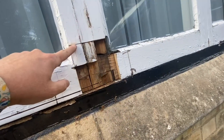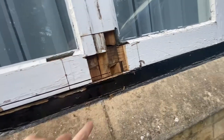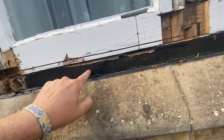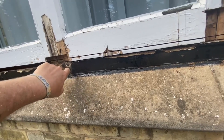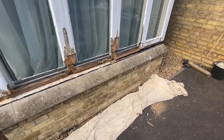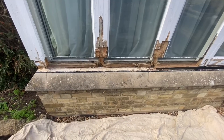What I normally do is drill a hole or put a multi-tool cut in until I find where it's not solid. I like to expose the tenons as well, just to make sure they're in good nick. I've done that on these two and I'm happy with that. I've actually got to take a bit out here though because this is rotten all the way through. I'll put some hardener in there and then I'm going to review this easy care product — it's supposed to make filling a lot easier. However, this side is going to need a lot more, and it's quite an expensive product.